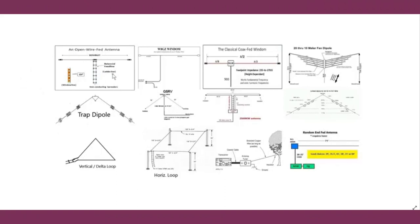This is probably the most popular antenna and has been for at least a hundred years — the open wire fed antenna. It's simply a length of wire, any length, fed in the middle by balanced line or ladder line. The antenna can be a half-wavelength long on the lowest band, or less, or a lot more. The length is not really all that important.